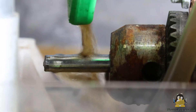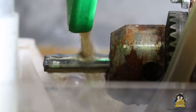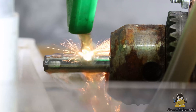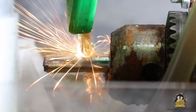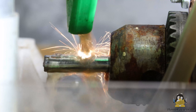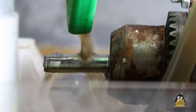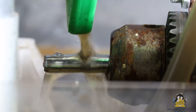Another application will be the 3D erosion of steel with this machine. For round parts I implemented a small lathe. Here the production of a screw is — let's say — simulated. The drill chuck has a visibly non-perfect runout, which is why the round steel would actually have to be probed first with the electrode in 5V mode, which is not yet implemented.